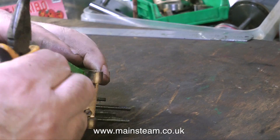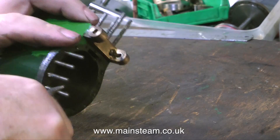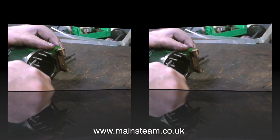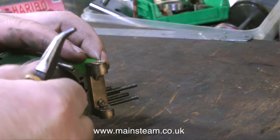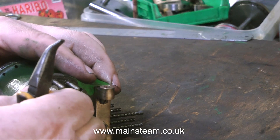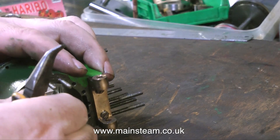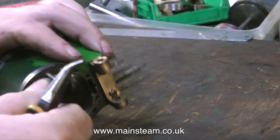In this clip I'm removing some tight studs. I would normally not use pliers, but they're really not that tight — just tight enough that I can't undo them with my fingers. If the studs are tight, never try pliers; you will just mash up the thread. And if you must use pliers, make sure you grab the stud by the middle part — the part that is not required to be threaded into anything. But disregard that comment — just do not use pliers.